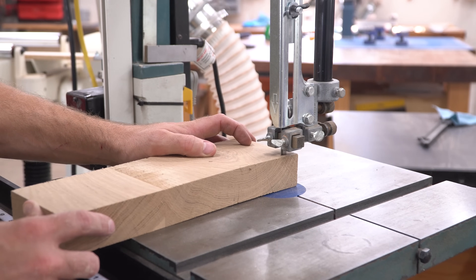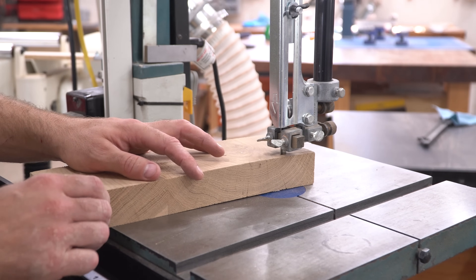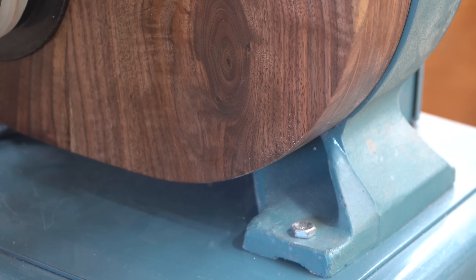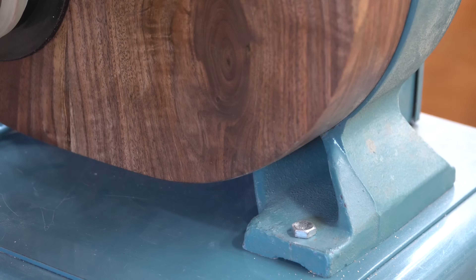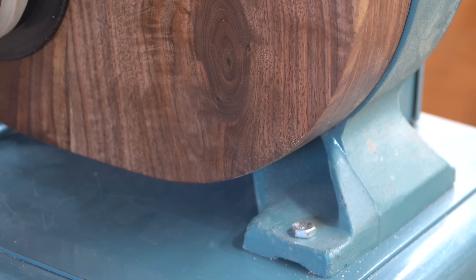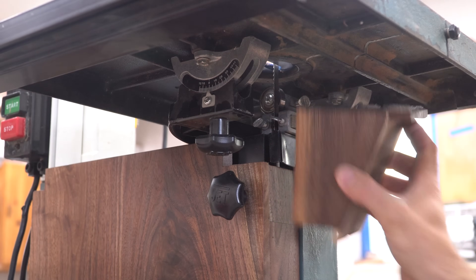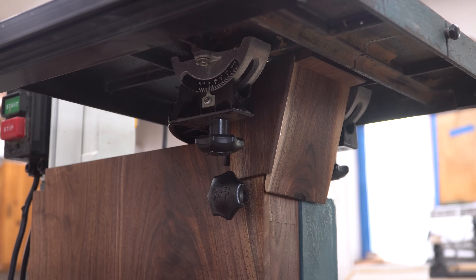To really see how this was going to work during operation, I started cutting wavy lines into a thickish piece of oak. With my old setup, this would be enough to look like a mess about halfway through the first cut. Now, there's very, very little dust escaping the draft of the extractor. In fact, some of the dust is falling around the outside of the door, then getting sucked back in as it gets near the openings in the bottom. I can confidently say that 100% of the dust that falls inside the door is being collected by the extractor. The only dust it isn't catching appears to be the particles that come through the table and immediately veer off to the side. To combat this, I made a magnetic shroud that sticks to the underside of the table and sends any escaping dust back into the cabinet where it belongs.